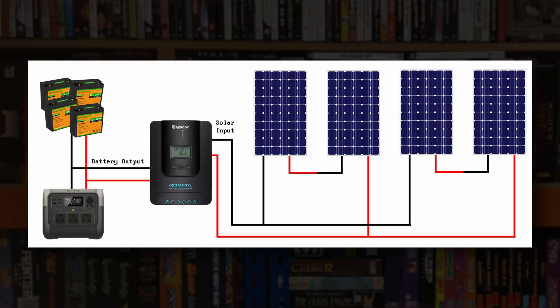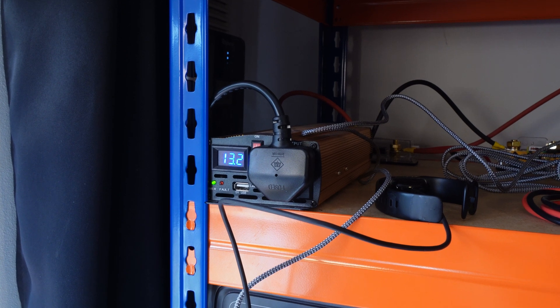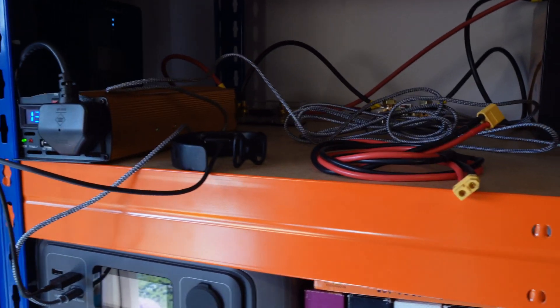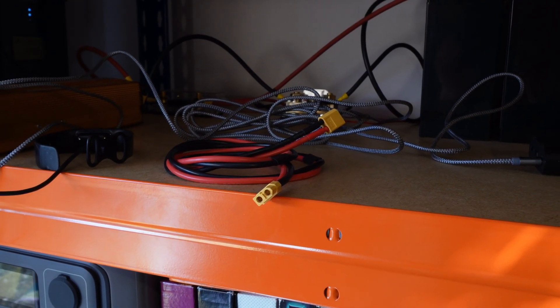So what about eliminating that inverter? The thought has crossed my mind that I could just hook the EcoFlow up to the batteries directly using the 12V input on the back — it has its own internal full sine wave inverter after all, and it's much better quality than my original one. But mixing and matching batteries on one charge controller is a big no-no, especially if they have their own BMS, so I'm not sure if it would affect the output from the Renogy or maybe even damage something. It would be fine in the evenings when the Renogy is basically doing nothing, but the concern is whether it would try to charge this along with the other batteries. Maybe I need some kind of DC-to-DC converter, or maybe I'm just overthinking things. For now, until I get a definitive answer either way, I'll stick with what I know.